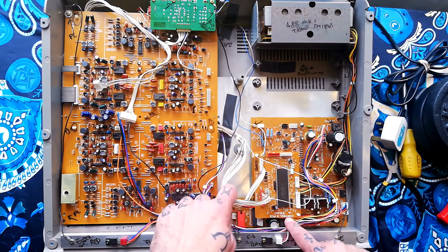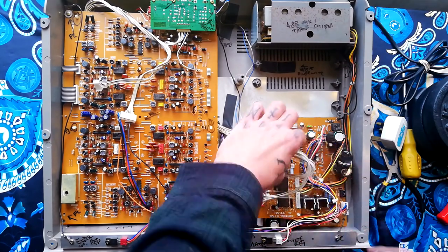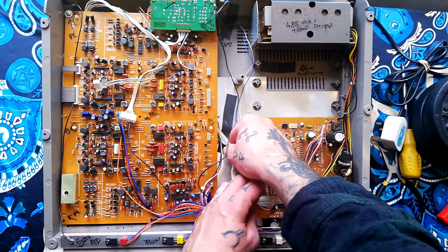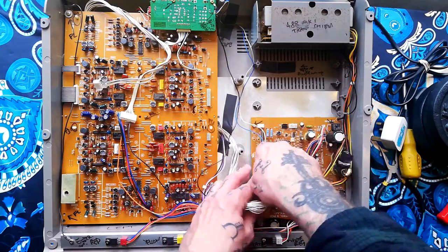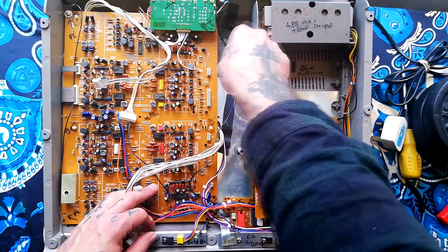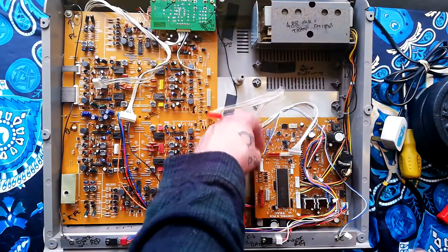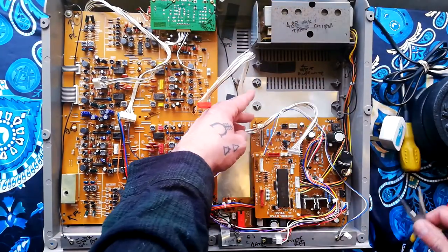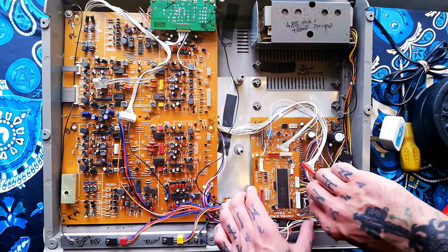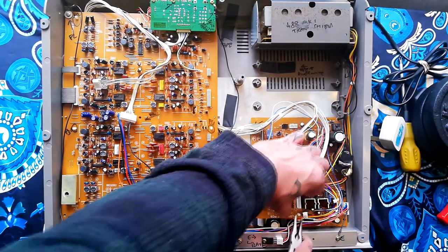For argument's sake, Control B has a problem and you want to resolder it. What do we disconnect? There are two cables going into the DBX. You pull them out with your fingers — blue and white cable with a bit of tape holding it down, going into the sync switch PCB. There are one or two plastic clip divider things that you need to pinch with a pair of pliers so they become narrow enough to pass through the board.